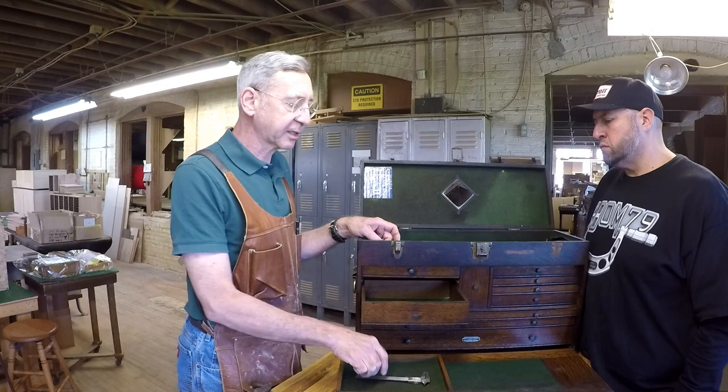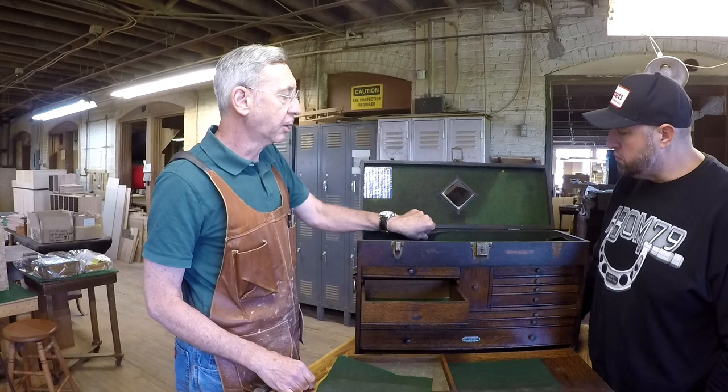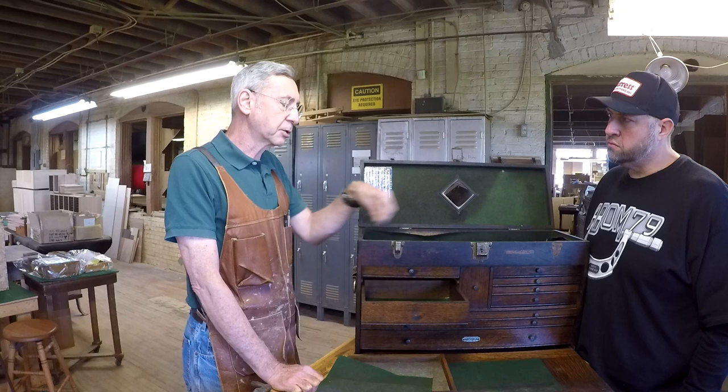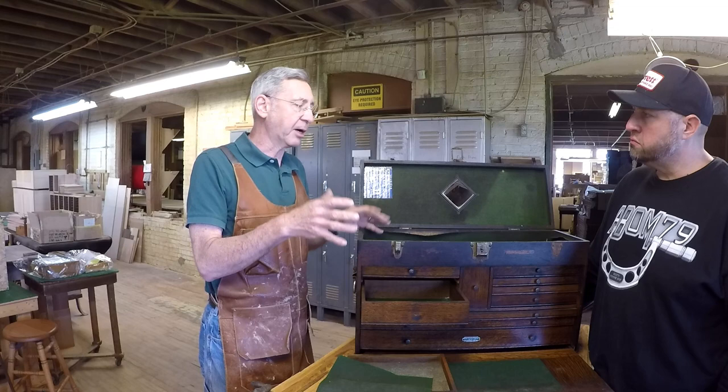So the first thing that I'm going to do when I start working on this chest, now this one pulls out pretty easily, so we'll just take that out and throw it away. A lot of times they're a bit more sticky when they go onto the wood. The way to get them off, and I believe there's a video about that, is that you will just brush water on it, let that water soak in, and that'll break down the glue. So the first thing I'll do is brush the glue, make sure that those come out. Then I'll start working on taking the box apart.